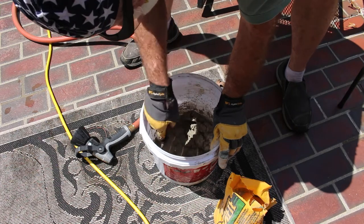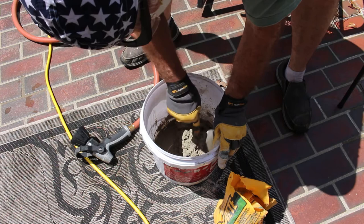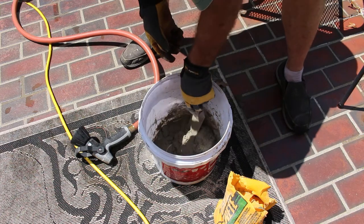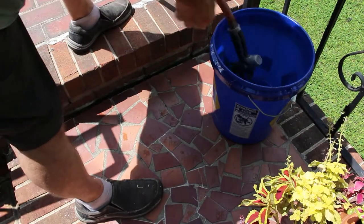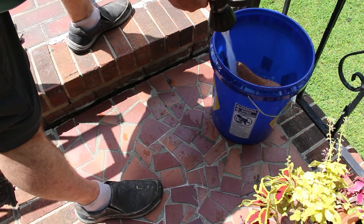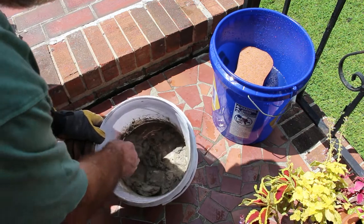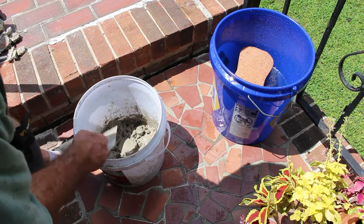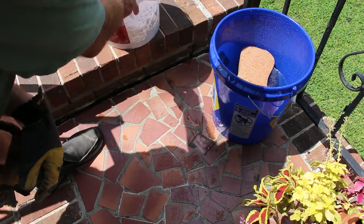It might be a little too wet, but I'm going to wet the bricks as well — because if you wet those a little bit, you'll have a better bond. If you apply it to dry bricks, the bond isn't as strong. For this project I want to make sure I've got plenty of working time, so I'm going to have it a little on the wet side. I went back and added just a little bit more powder — you can see the consistency, it's a lot thicker. It stays on the trowel pretty good. You'll get a feel for it as you go along.